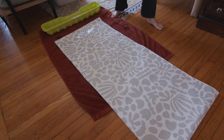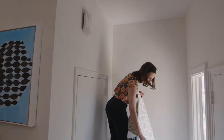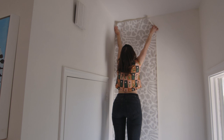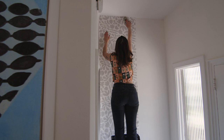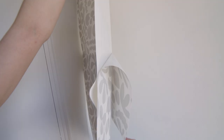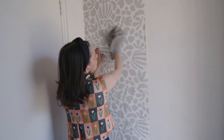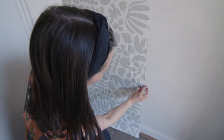Check that the entire backing has been wetted. Add a splash of water if you see an area that is dry. Keep the panel folded up while you set up your ladder. When you are ready, take the panel up the ladder. Unfold the top half and place it onto the wall. Take it up an inch above the ceiling line, making space for minor changes in wall height along the way. Use a damp cloth or sponge to begin smoothing. Press the paper into the crease between the wall and the ceiling and keep smoothing gently. When you are ready, come down and release the bottom half. Continue smoothing downward and outward. You want to try and smooth as many of the bubbles as possible, doing so softly.